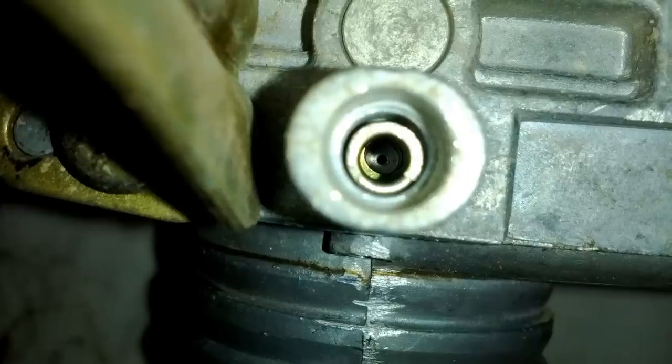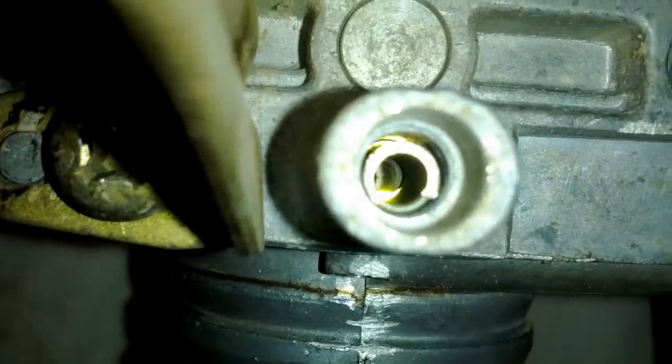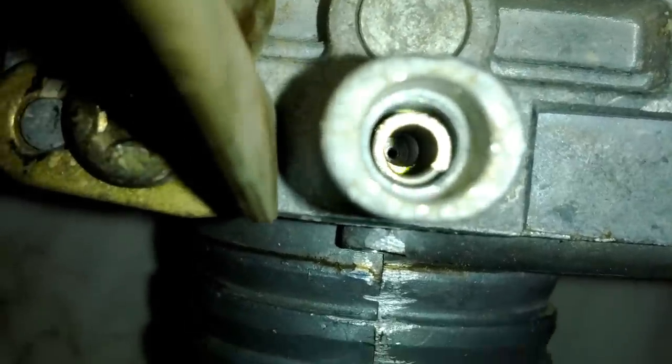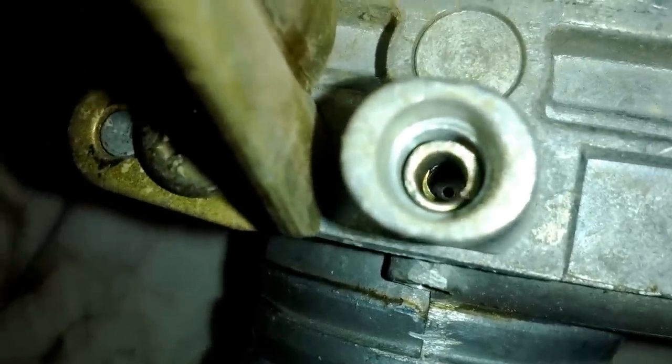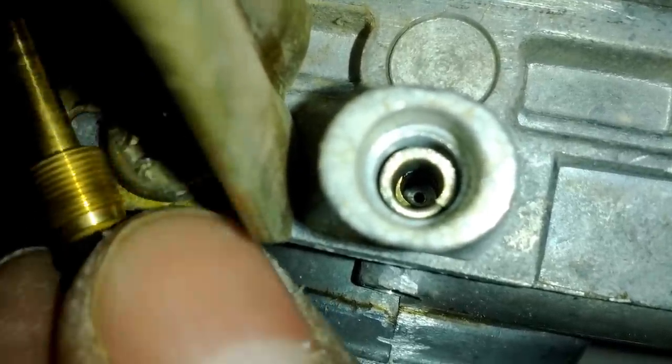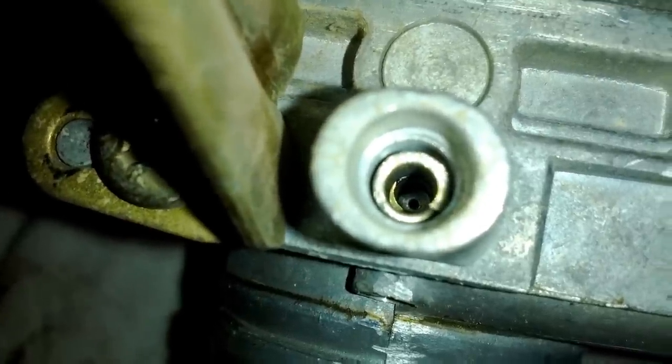Well, let me go ahead and clean it out a little and plug it back in. Oh, look at the gasket. It's old. I think I have one of these. Once you're done, do all these steps in reverse order to put everything back together. Okay, that's a look into the pilot screw chamber. After looking up what it is, it's what basically controls the flow of the jets right here. So, this is very important. I'm guessing this chamber has to be clean, but I don't read anywhere that it has to be compressed. So, I'm going to go ahead and put a new gasket on this sucker right here, and then plug it back in, see what it sounds like.